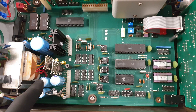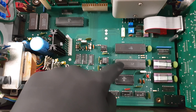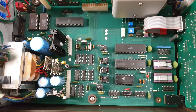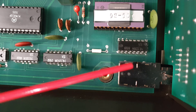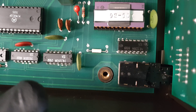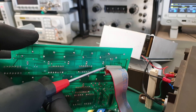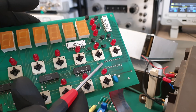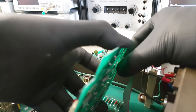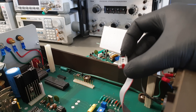This beauty is made up from four PCBs. The mainboard is boring: power supplies, optical isolation, a microcontroller and associated components. Notably there's no precision analog stuff, no PTFE standoffs, and no guard traces on here - so a little bit of universal snake oil spray won't do harm. It may not save the power switch forever but it rejuvenates it and lets me proceed until I find a proper replacement. The front panel board is connected astonishingly poorly with a press-fit ribbon cable terminal - I have no scientific evidence to support my claim, but I'm going to say it anyway: that sucks. I'll replace that with a precision IC socket, but alas it was not what caused the missing segment.